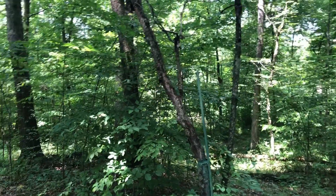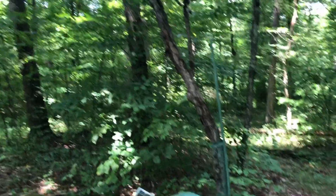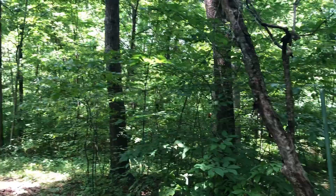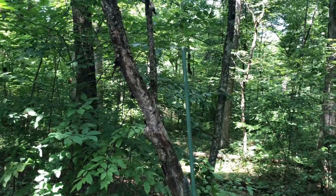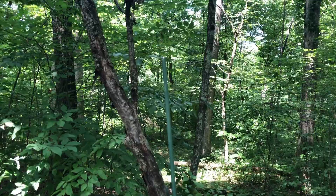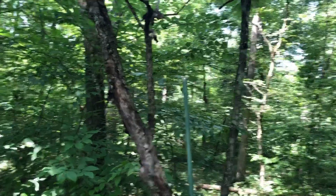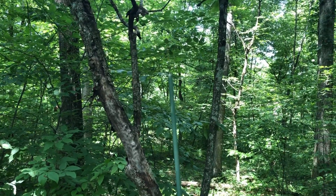Now the big test is to see how far out I can get. Looks like I'm shooting pretty good in the direction that I want it to go. This is UHF — it's different than VHF or HF. UHF is really good for punching through things; it can go through concrete walls. It's a pretty powerful waveform and it'll cut right through these leaves, no problem. The only thing bad about UHF is it doesn't really bend — the radio wave doesn't bend with the horizon like VHF and HF and LF do. It should be fine for what I need. If not, I've got plenty of coax and I can raise the antenna. Last resort, I'm going to put a beam — a Yagi antenna — and point it the way I want it to go. More testing will be done.